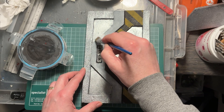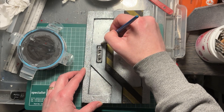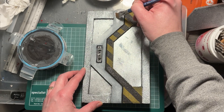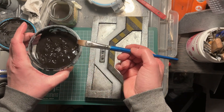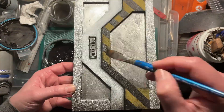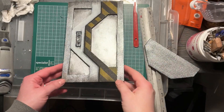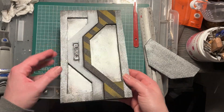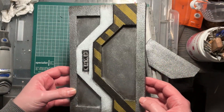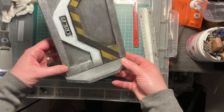The white paint has faded a little as it dried, so I'm going over the top of it a bit more just so it looks a little bit fresher, leaving the edges so it has a distressed look. Now I'm taking a little bit of black paint, rubbing most of it off my brush — a dry brush technique — and scraping the edges, particularly the top and bottom of the door. As the door has been opened and shut, dust has blown against it, creating that wear and tear look, giving it more of a worn and used appearance.